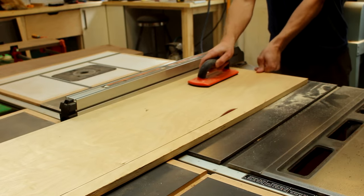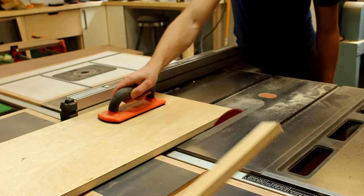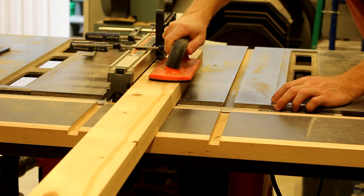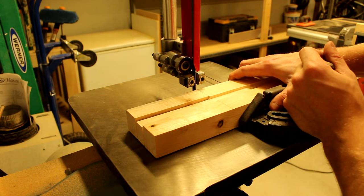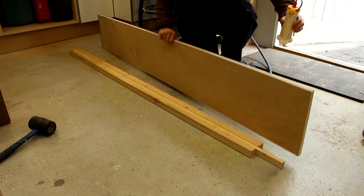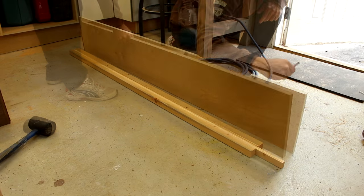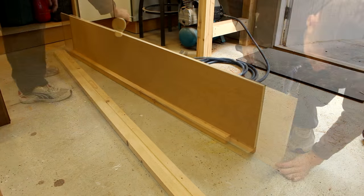The center I-beam is made by 3 quarter inch birch plywood capped with 2x4s. To provide for wheels in the drawer assembly, I had to cut out material from the bottom 2x4. I run glue along the dado we cut earlier in the 2x4 and use a dead blow hammer to seat everything in place, then repeat for the top 2x4.